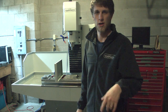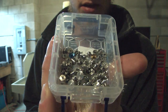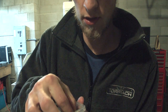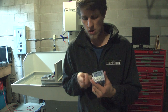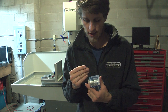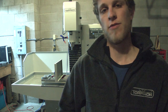While Eric's sharpening my knife, I remembered something I wanted to talk about. A few weeks ago Eric made a bunch of titanium spacers, standoffs, and thumb studs — including a blue anodized titanium thumb stud. I do have a CNC lathe, but this is a complicated part to make on it because it doesn't have a tool changer, and it ideally needs to be tapped while on the machine.